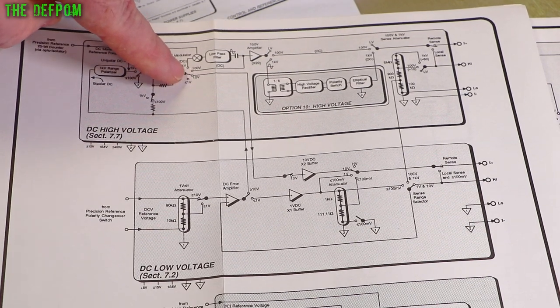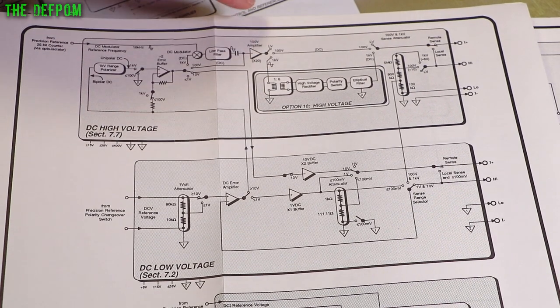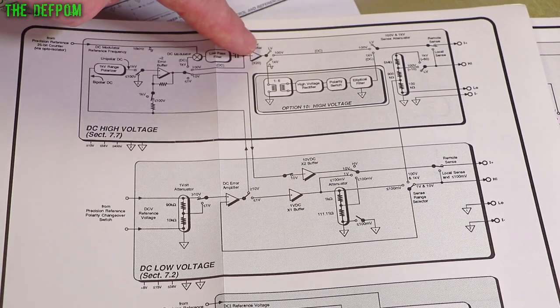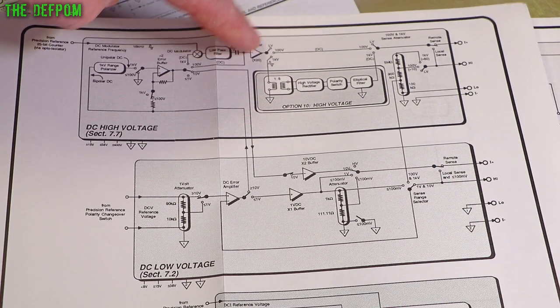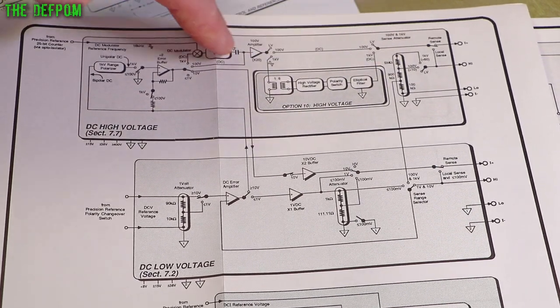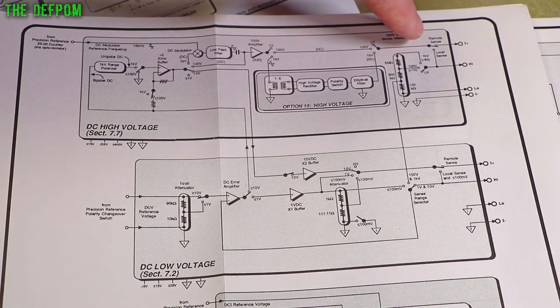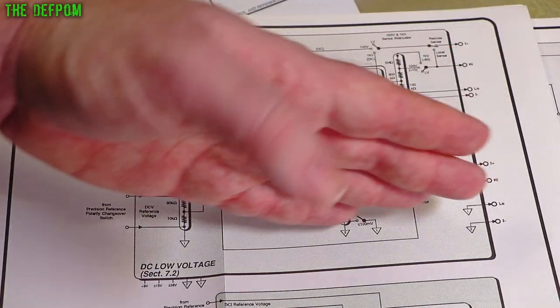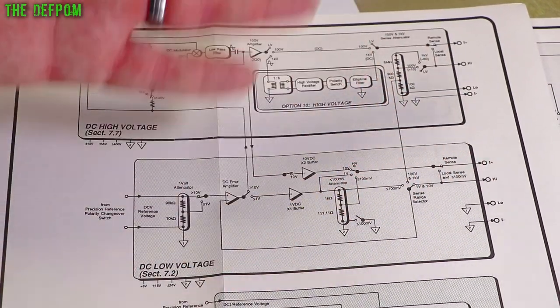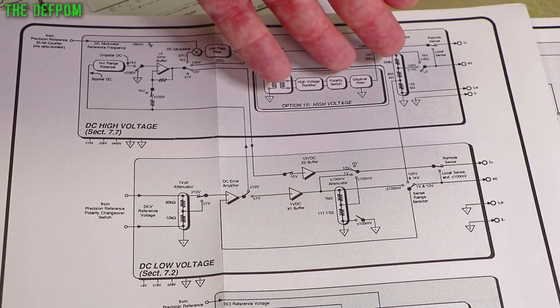That then comes through. As I said, 10 volt comes back. 100 volt comes bypassing this low pass filter section through the amplifier, through this switching. So here we go. Low voltage, it disconnects the amplifier, so there's no possible feedback in both ends. 100 volts passes straight through and comes back, right, to the terminals. So it goes to the terminals, right? All the terminals are wired up in parallel across the boards, and the boards disconnect and reconnect as required. So this board outputs directly to the terminals.